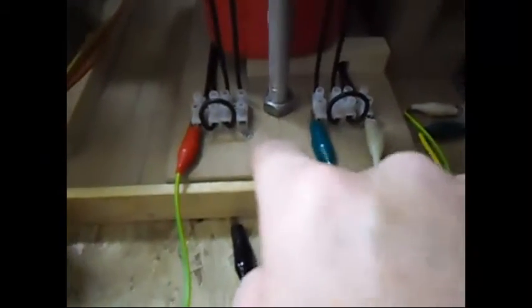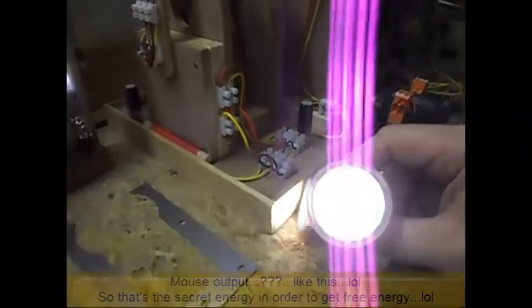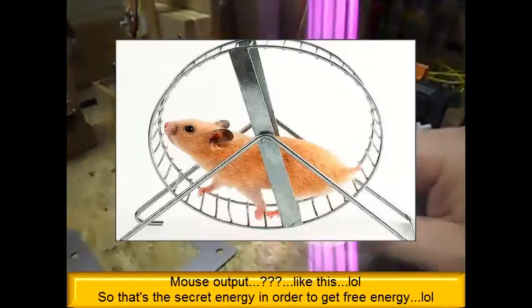As you can see, it is completely now wired differently. Before I had the two bottom coils in series, now I have the two blue ones in series — this one and that one, so across. And the red one over here and the red one over there in series, across. I'm going to do the same test with the transformer and the 3W AC load. Connecting now — and bingo, I got output, without having to short the other two.